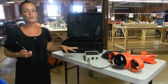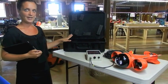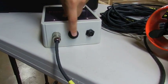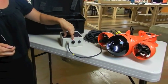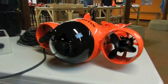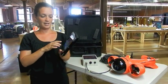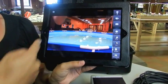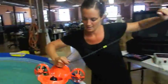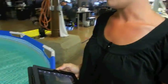I'd like to show you what you would do when you get down to the water to get this ready to go. Take all of the pieces out of the waterproof carrying case, screw in your cable connector into the topside box, then flip on the power switch — you'll see this red light come on. Within 60 seconds the vehicle will begin to blink, which means the HydraView is telling you it's ready to go. Once you see the blinking, turn your application on and you'll see right here we're getting our live video of our test pool. That means we're ready — just take her, get her right in the water, and turn the throttle on.